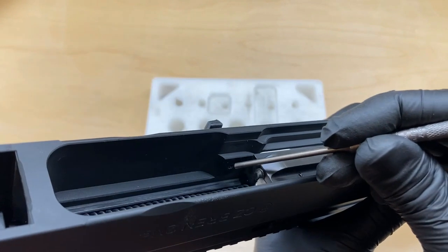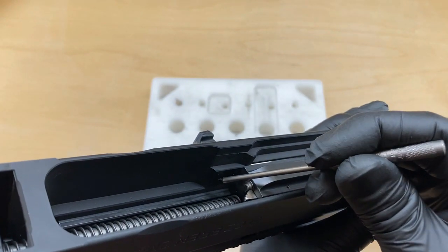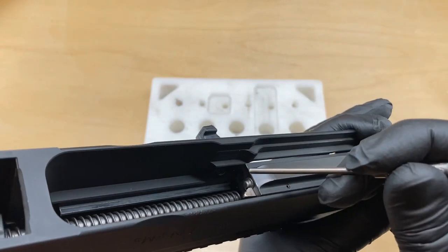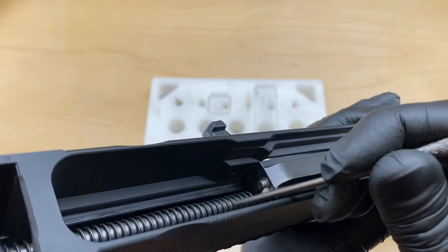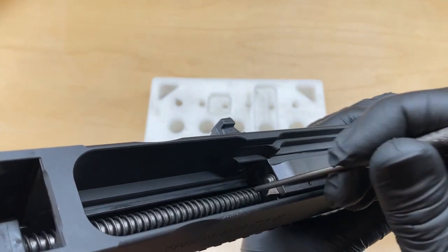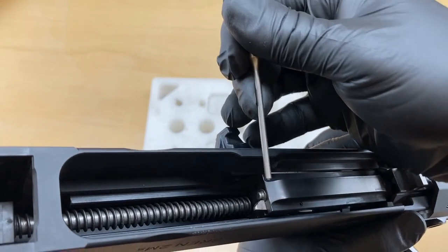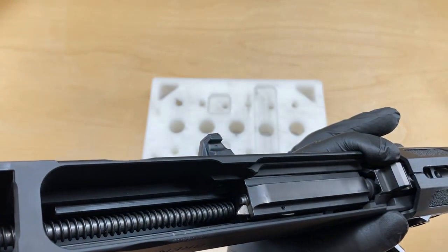You can take a look before you do that. This hole behind the bolt in the upper receiver is where the securing roll pin is located. You'll notice that it doesn't come close enough to the bolt or the recoil rod to interfere. So what we're going to do is drive that roll pin all the way into the upper receiver and just let it fall out.